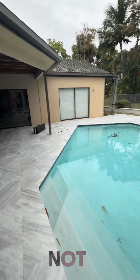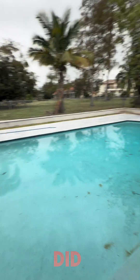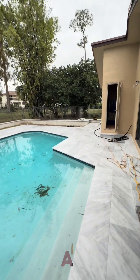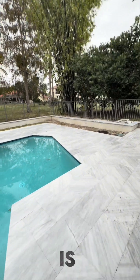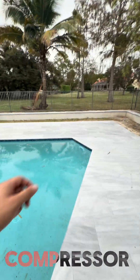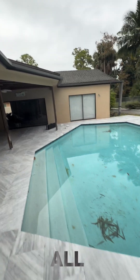While we did that, we really did not get any kind of signal at all. The pool was dead quiet. So the next thing we did is we started to introduce air into the line to see if we can get a little bit more commotion, a little bit more turbulence, because with your air compressor that's when you're going to get the most noise produced when all that air is escaping out of the break. The first few times we used our air compressor, we did the same thing — we listened all around the edge of the pool and we did not get much of a result at all.